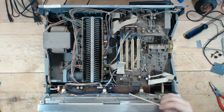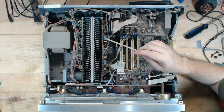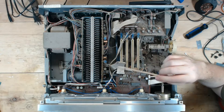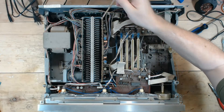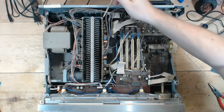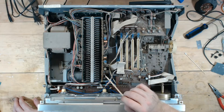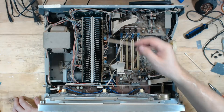Issues with these amplifiers on the amp board: these pots are known to go bad — any of these variable resistors are known to have issues from time to time. You'll notice there are some transistors on the board with fat middle legs. On the amp board, those transistors with fat middle legs are known to have cracks around those legs — a cold solder joint crack — and it will cause this to go in and out of protection, taking diodes and resistors with it.